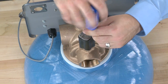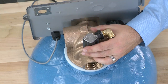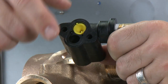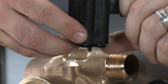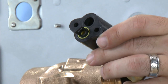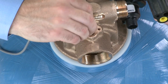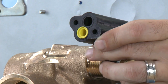Using a quarter inch driver or a slotted screwdriver, we can loosen the two screws. On the top plate, we will see that there is a number 3 stamped into it. Inside, we can see where the injector is, but on the 1700 system there is no screen. On the bottom side of the injector assembly, we have our regular gasket but also the flow disperser at the bottom. This may be on the bottom of the injector assembly or inside the body — make sure you only have one piece or you will cause damage.